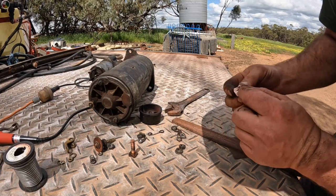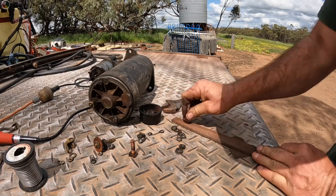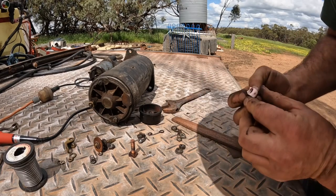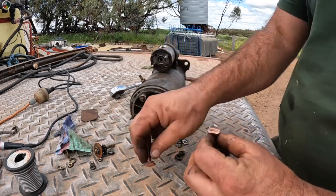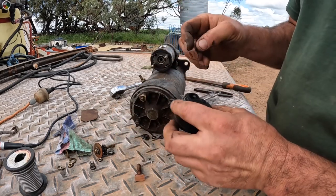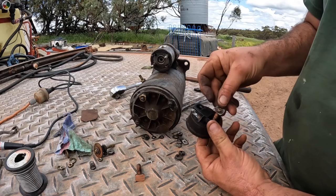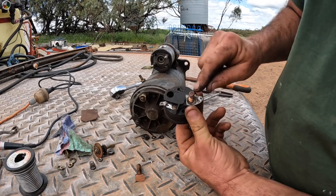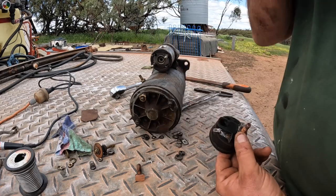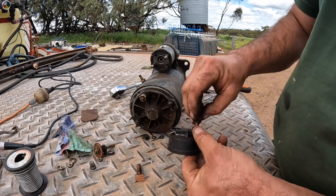The other thing you can do with these is build them up with a bit of silver solder and then make a nice flat smooth surface. Now we're going to reassemble all of these bits. The most worn contact was the negative contact, so that goes on the bottom here with the tab that we soldered going over this hole. Then washer, spring washer, and nut.